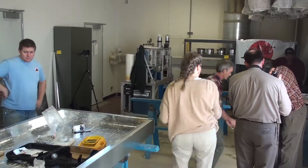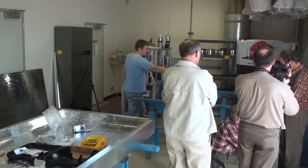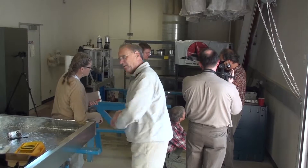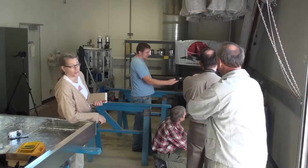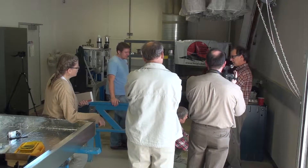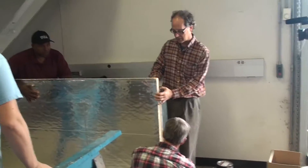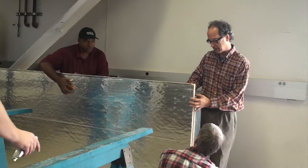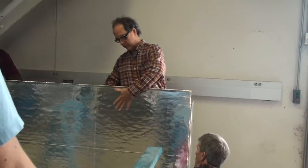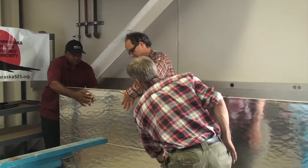Now here is the tricky part. You want to make sure that you have enough room on both sides so that when you score it — you can't use a knife yet, because we are just going to score it and see where it is — then we have to cut inside the line, because the sheet metal is about 16 or 18 gauge and it is bent and you have to allow for a lot of room. So we will just run across here and score the line. You can do this with a pencil, a pen, a magic marker, whatever you got.